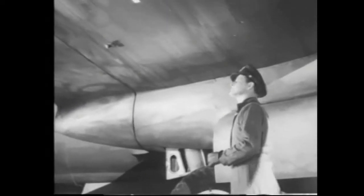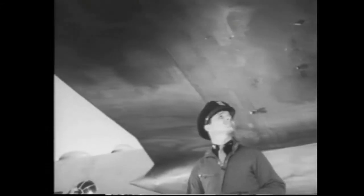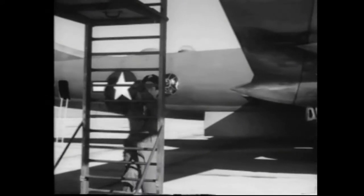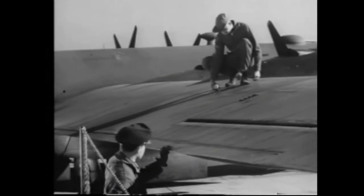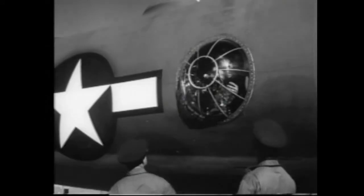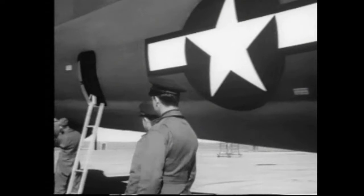While you're walking along, you can examine the wing seams — fluid leaking from them means trouble. Now to check the ailerons and trim tabs. All control surfaces and all trim tabs must be inspected. Test the tabs for excessive hinge play by shaking them, and see that the gas tank caps are tightened. If there were extra fuel tanks in the bomb bays, their connections would have to be examined. But the pilot and co-pilot continue their tour around the plane — they have a lot to check: hatches, windows, control surfaces, trim tabs, inspection plates and doors.